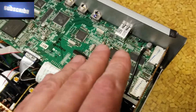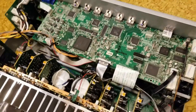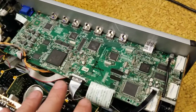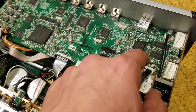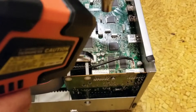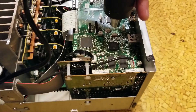I'm going to try the actual repair now. I'm doing a quick close-up of the board numbers before I forget, so anybody who needs them can see them. I was going to try to pull out this board, but it has like a million connectors and about 10 screws. Trying to get a wire out, I already broke a connector. After spending like 20 minutes bending little fingers back, I said I don't want to go further downhill — let's just get the repair done. I'm going to start preheating it, targeting around 300 degrees or so.